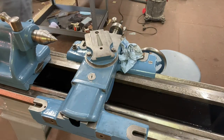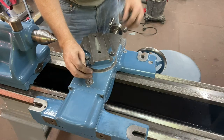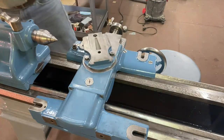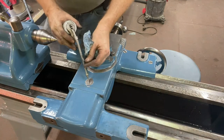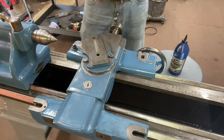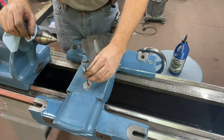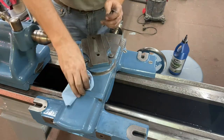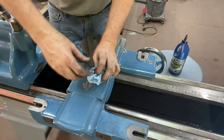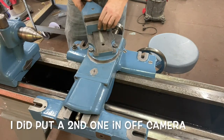I'm going to put a little bit of oil in here and here, and then I think I'm going to call that a day. I like how nicely that comes out — love it when it's clean and the threads are not bunged up. I'm a little worried I made that too loose — like it's just going to vibrate down. I guess if it does I can put a double nut on and jam it. Here's our next part to go on.